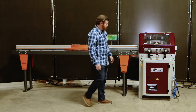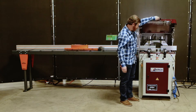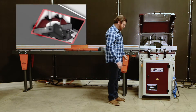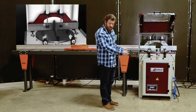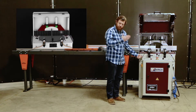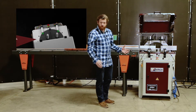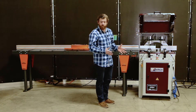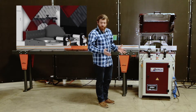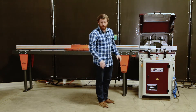Today we're going to talk about some different features on this saw. This saw has a manual hood and automatic clamping, two-button push for safety, an adjustment feature to determine the speed of the blade — how fast it cuts through the material. This saw is capable of cutting full billet aluminum or different profile extrusions, C-channels, I-beams — almost anything aluminum that you can put in this envelope, this machine can cut.